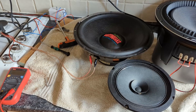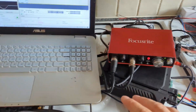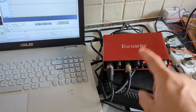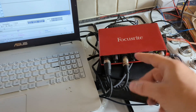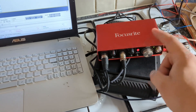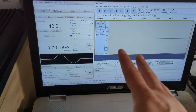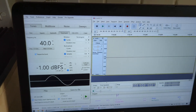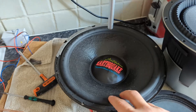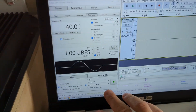For now I'm testing only these three because I have them on hand. I'm using the Focusrite Scarlett because I need a very high sample rate — the UMIC is limited to 48k but this can run at 192k, so I'm running at 192k to get the most samples possible. I'm using two programs: REW for the generator and Audacity to record what's coming from the speaker, using this XLR microphone.